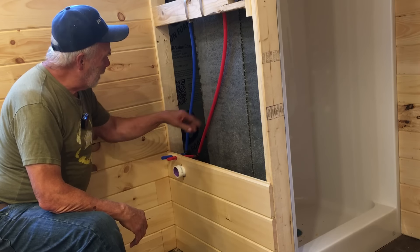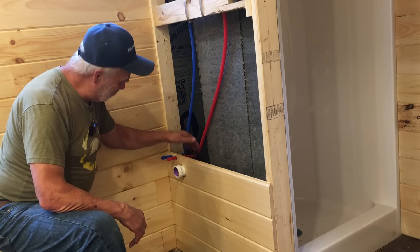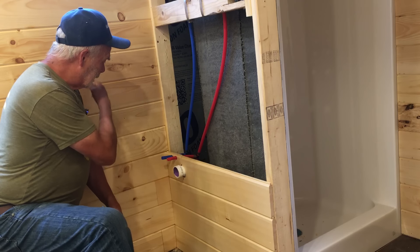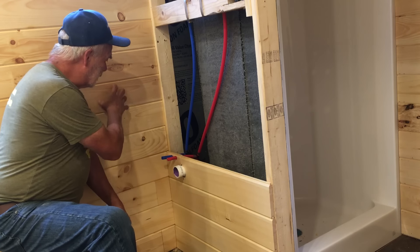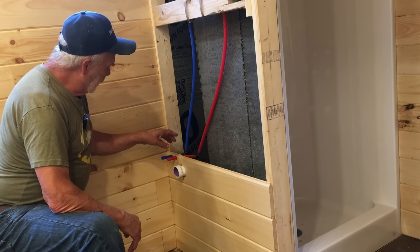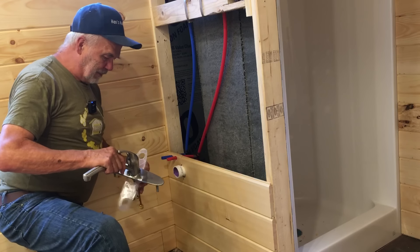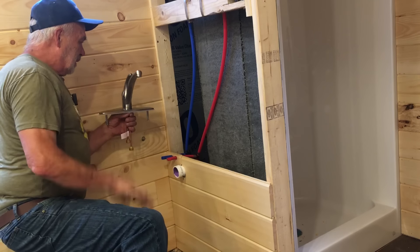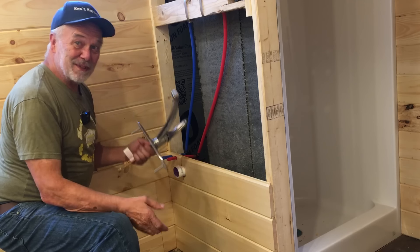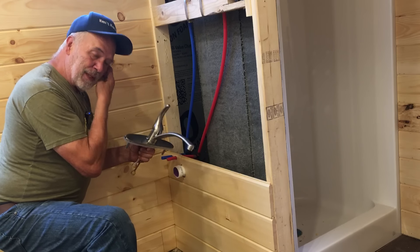These are the only two water drain setups in the building. I have the half-inch PEX which is all teed in and tied in and goes down outside. The hot and cold — when they come in, one will extend over to the hot side of the sink and the cold will be on the other side, and the drain will come over to a p-trap to finish that off. This is the sink faucet, so it's going to be over here. If I turned it on full bore, the flow rate is 2.2 gallons per minute wide open at 60 psi.